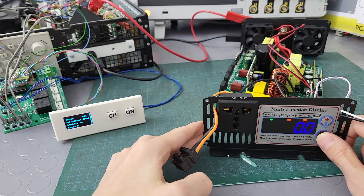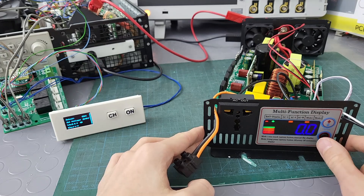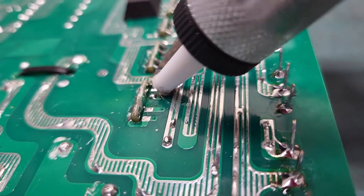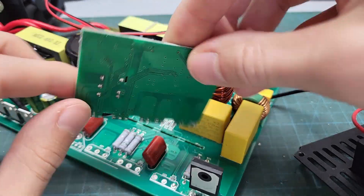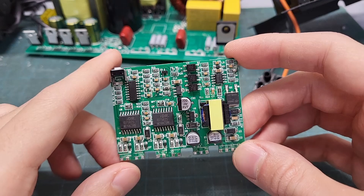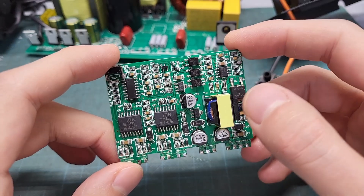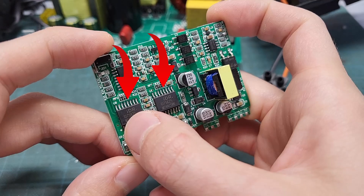Power on — and woohoo! This time we're completely at zero volts output. That's perfect — it confirms the issue is on the driver board. So I started disassembling it, desoldering it from the power board, and after quite a bit of cleanup I finally managed to remove it. Here it is: the tiny control board for the actual inverter — the part that creates the pure sine wave PWM signals for the four MOSFETs.